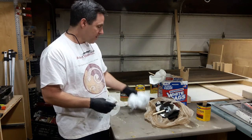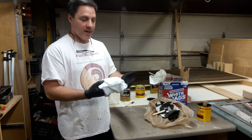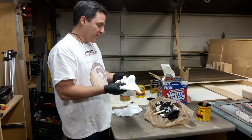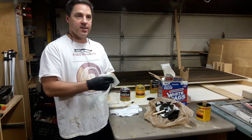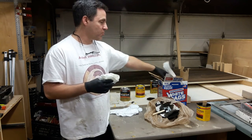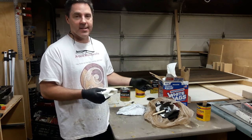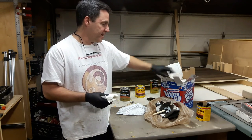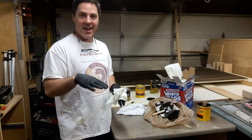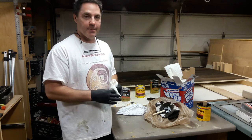These are just white general rags — not special purpose — you can get them in any aisle. You can also get these white paper cloth rags: they tear pretty easily, but when you don't tear them they don't leave a lot of dust or lint on the project. I wouldn't suggest using them during polyurethane application, but for wiping stain off they work fine and it's a lot better than wasting good rags. I actually bought these by accident — I didn't read that it said paper cloth. They work really great to absorb excess stain puddles after application. Thanks again!